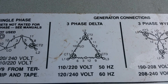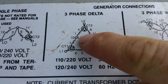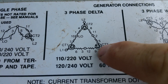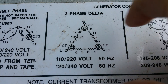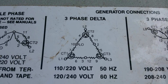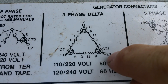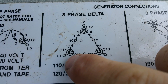For those who are not familiar with voltages, that's the neutral right there. L1 and L2 will put out 120 to ground. L3 will put out 208 because it has to travel through all these windings to get back to the low point — basically the neutral. And that's where a lot of people get screwed up: L3 is the stinger, so it's going to put out 208 instead of 120 to ground.